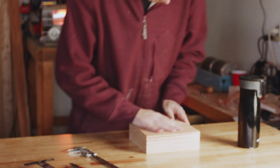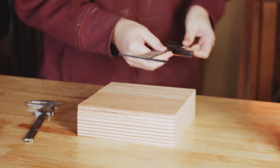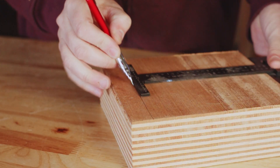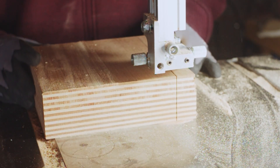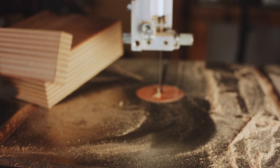I'm preparing a blank by laminating thickness-sanded pieces in an alternating pattern. I glued them up and thicknessed the block first to establish the stock size for setting up the milling toolpaths. This is an absolute ton of work — rough sawing each slice, joining each on edge, thickness sanding each veneer, and finally gluing it all together. These are alternating layers of basswood and African mahogany, just what I had on hand at about the right size with good contrast.